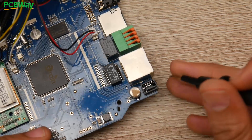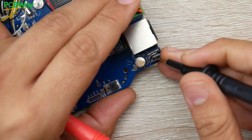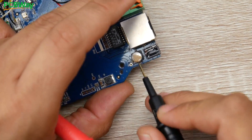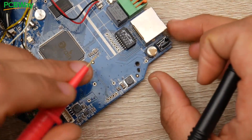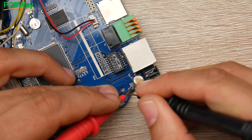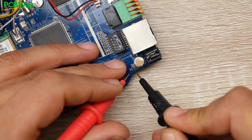If you're able to touch where the pin was, it's going to be really hard to see anything, but there's a little piece of metal left over inside there. There's also another five volt point close by — usually these holes are left so they can quickly verify the device is working without constantly plugging things in. If we touch the inside where the pin used to be with the multimeter in continuity mode, it beeps with the five volt pad, confirming a direct connection.